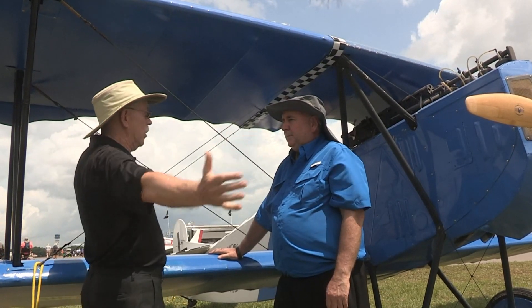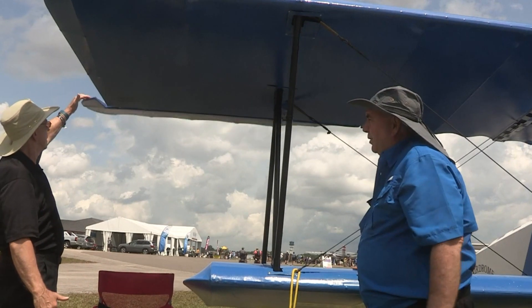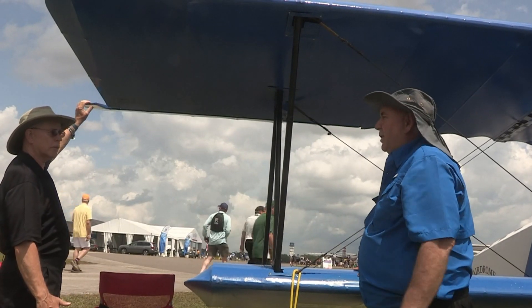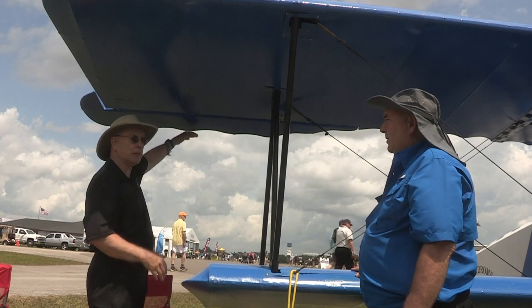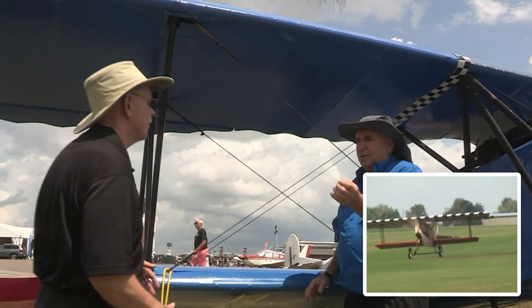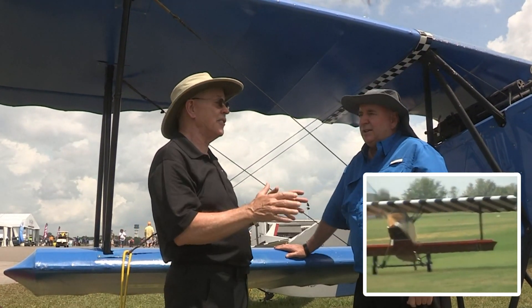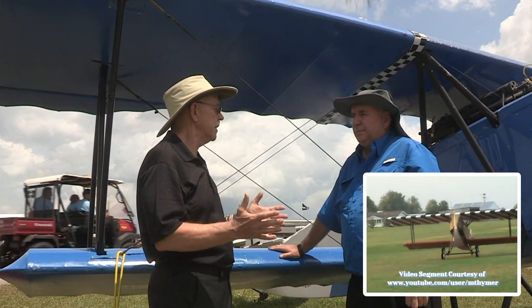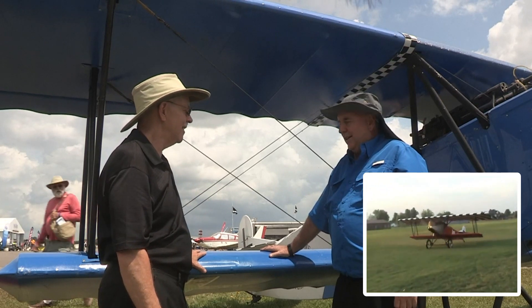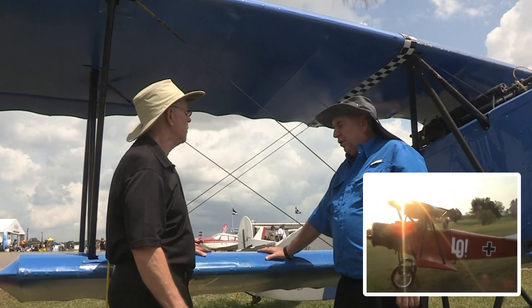When you say elephant ear, there's a portion of the aileron that's in front of the hinge line. You can actually see it if you look closely — it exposes itself like a modern-day spade on an aerobatic airplane. If you don't know what a spade is, it's the part that hangs down from the aileron — kind of like power steering. You see them on high-performance aerobatic airplanes. This has a little bit of that built right into it, so the controls are nice. They figured this out back when the Fokker D-7 was flying as its original — 1917, about 14 years after the Wright brothers' first flight. Anthony Fokker was a pretty smart guy. We do have a newer, more modern airfoil on it with a different leading-edge radius, so it's more benign in its stall characteristics.